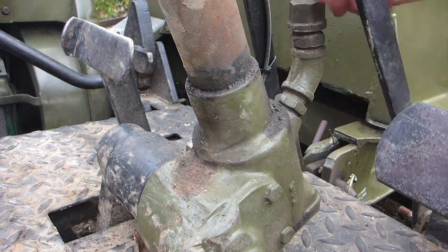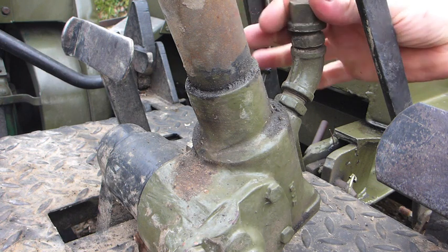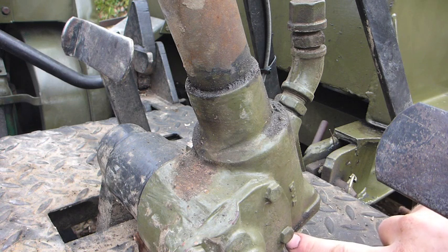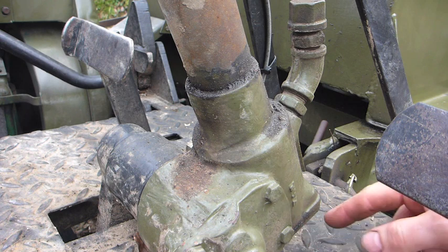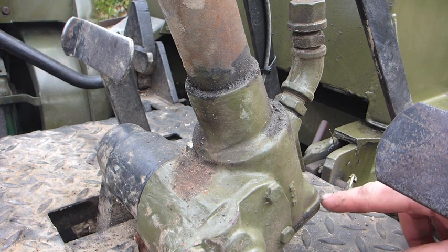You can see I've got a little weeping going on, so my top bearing is always covered in oil. As well as the top bearing failing, the bottom bearing can fail because water's got in. There's a little plate here — you can undo these bolts and check there's no water in them. There are some shims in here, so be careful when you undo it to make sure you don't lose the shims.